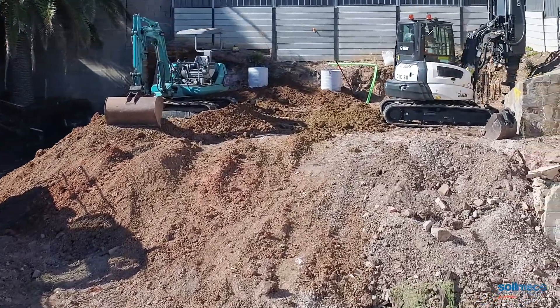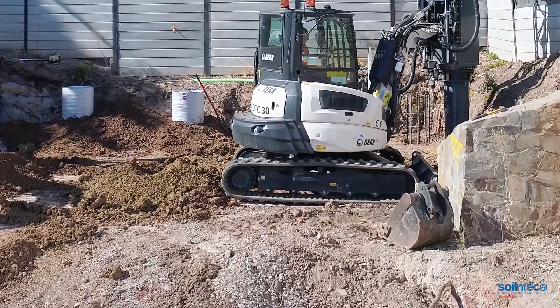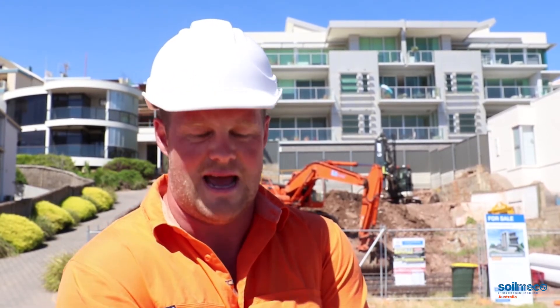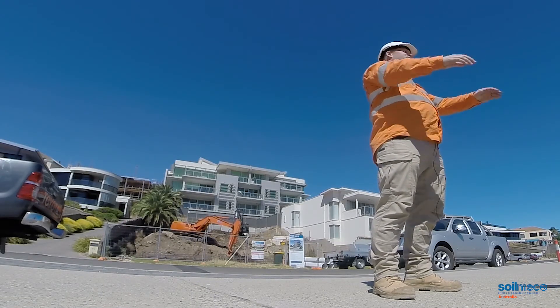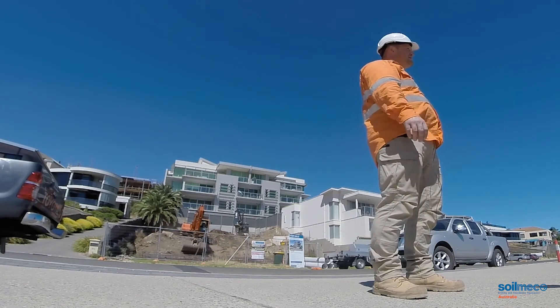If you're drilling over the dozer blade it doesn't really matter, but if you're drilling over the rear of the machine you can notice the machine is slightly front heavy. You have to be a little bit more careful when you're going up and down inclines, up ramps, things like that. Even coming up here, you've got 9 metres difference between the road and the building site where we're drilling. That ramp there was quite steep. I'd just lean the mast forward slightly and have the dozer blade up just a touch — it was going up the hill, no problems at all. Standing there looking up, it looked very steep, but the machine was quite well balanced. It did work out okay.